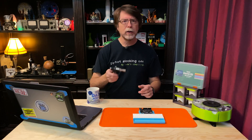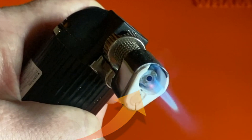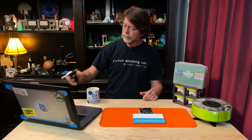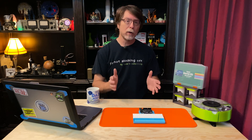The piezoelectric effect is the ability of certain materials to generate an electric charge in response to applied mechanical stress. It's like the igniter on this butane torch. When I press the button, a spring-loaded mechanism applies a sudden compression force to the piezoelectric material, which generates enough voltage to create a spark to ignite the gas. An interesting characteristic of the piezoelectric effect is that it is reversible, meaning that materials which generate electricity when a physical force is applied also work in reverse.